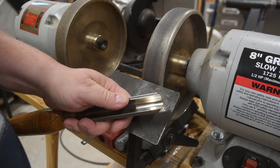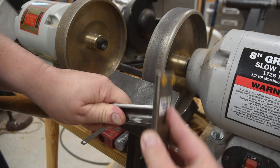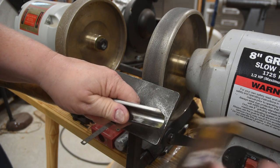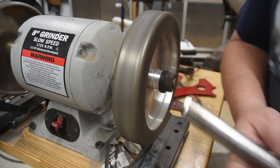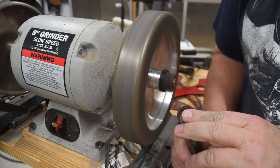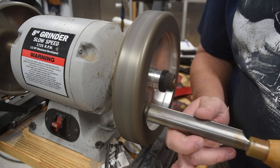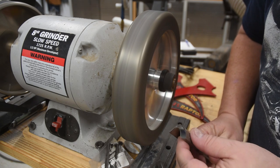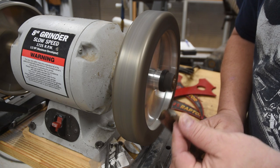I'm going to use this as an example to show how you can reset all your gouges. I can take a board with sandpaper or a grinding stone and go at it at 90 degrees until I get the shape I want. Or if you have a diamond grinding wheel designed so you can push sideways — friable wheels you can't — I can come over here, get it at a perfect 90 degrees and just lightly touch it. See it's touching on that side, not that side. Then go back to the regular grinding wheel and keep grinding until that little flat goes away, and you'll end up with a perfectly shaped spindle roughing gouge.